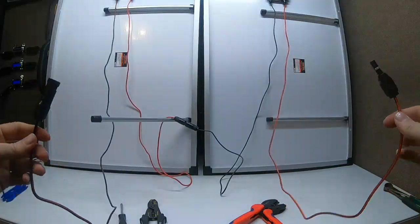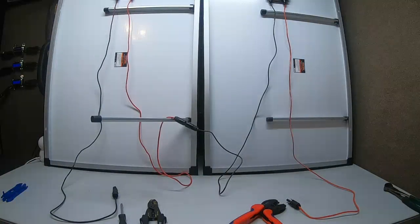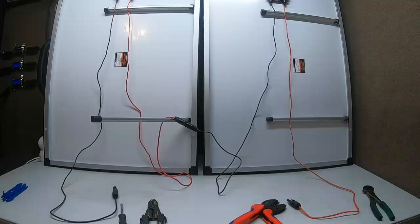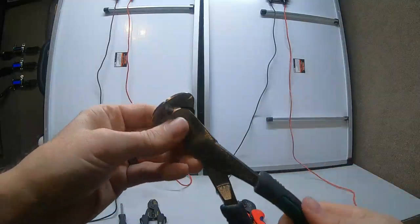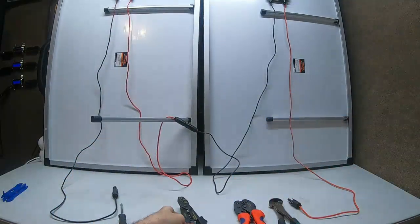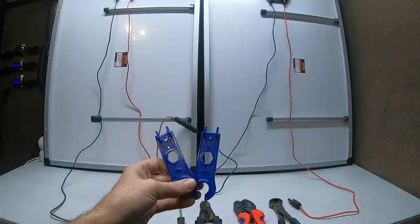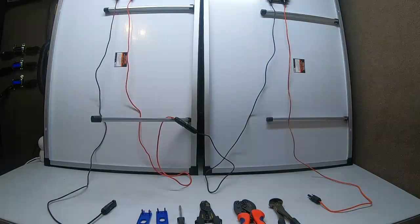You guys did a fantastic job. I'm trying to make very basic videos because when I was first learning, the basic videos were hard to find — everybody was so advanced, I felt left behind. So to recap: you need your crimper, nippers — never cut positive and negative together, bad idea — wire strippers, a screwdriver in case the wire won't cooperate, and the little MC4 wrench tools that come with the Bouge RV kit — I'll link it below. Thanks for paying attention, I'll see you on the next Rambling Bob video. Travel safe, bye.